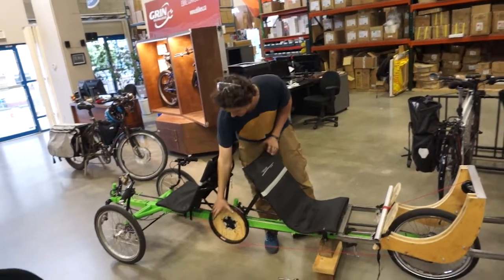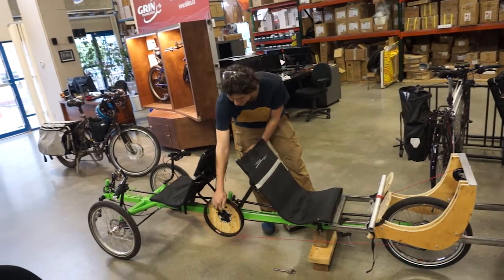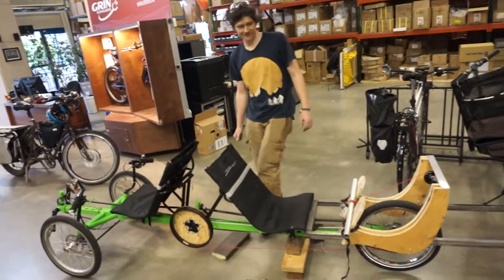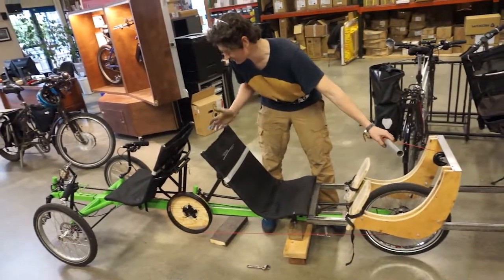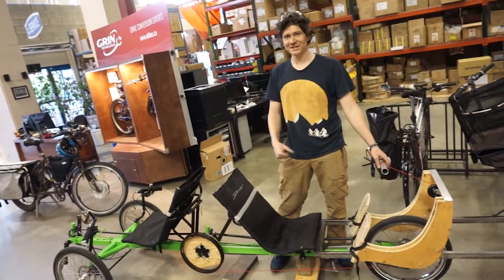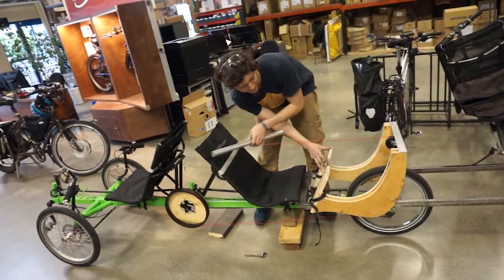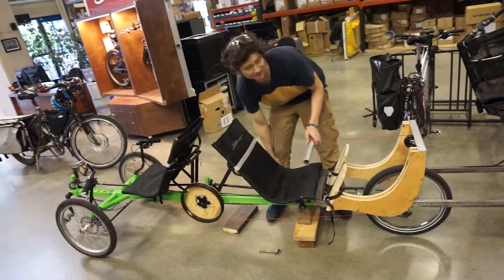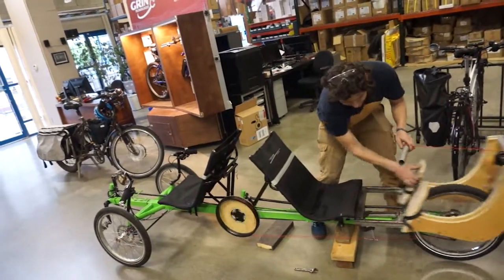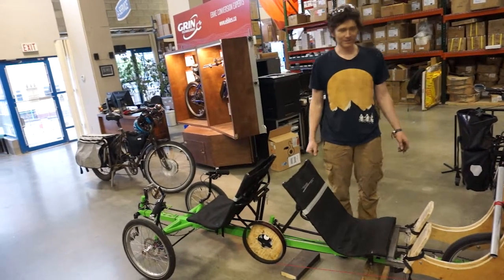What we realized was that the drum diameter needed for 62 inches of string pull was much larger than initially envisioned, but I solved it by using a 16-inch bicycle rim. This is now the first fully fleshed-out working prototype of the rowing mechanism tied into our Sun Trip bike. The system lets your legs and arms go through the full rowing motion. With the arms, I'm pulling rope one-for-one; with the legs, it's a two-to-one ratio — a given amount of leg motion produces twice the rotation on the rear wheel. I think that gives a better balance for the arm-to-leg muscle ratio.